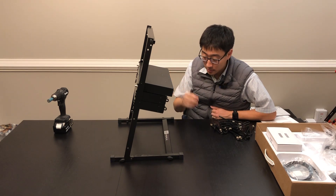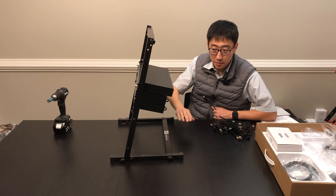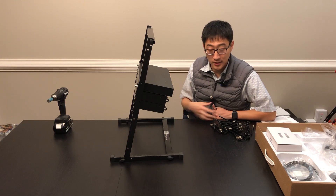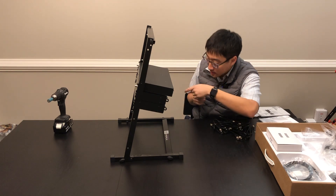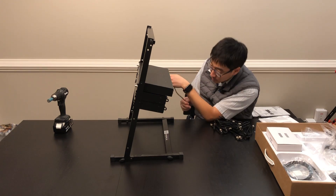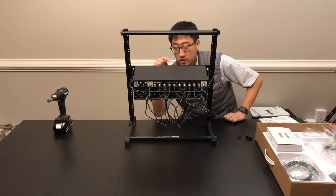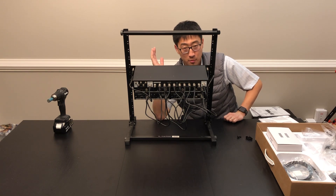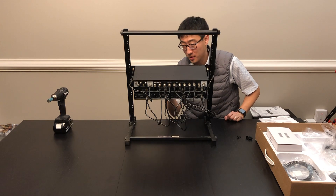When you're doing something like this, so you don't cross-mingle or reconnect the wrong antennas the wrong way — generally when I do this I like to do all of either antenna A or all of antenna B at once. That way you don't accidentally connect one antenna to antenna B and the other diversity antenna also to antenna B, leaving you with no antenna A. So make sure you keep some kind of system to keep it organized. We're going to do all antenna A first. That's what it looks like when all the RF ports are connected — it looks like a cable management nightmare, but usually it's going to be in the back of a rack which will be closed or hidden. There are two cables for each unit, so imagine how many cables you end up with.